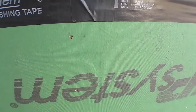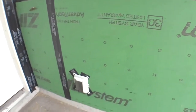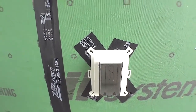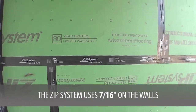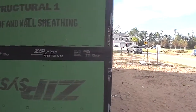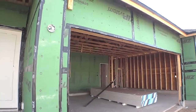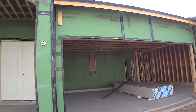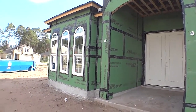There's going to be siding over the top of all this, but if they ever breach it all the way through, they'll fix it with the tape — like what they did here with the outside receptacle: they flash it and make sure it's completely sealed. It's a great product. They use 7/16 on the walls, usually 9/16 if they do it on the roof, and they have a product for flooring systems on two-story homes as well. It adds structural integrity to the house, saves the step of wrapping, and is really great for the home. Anyway, just wanted you guys to see this — have a great day.